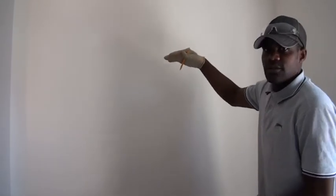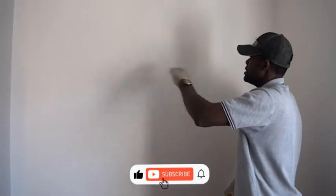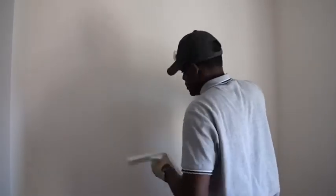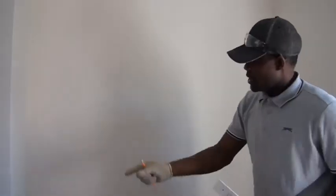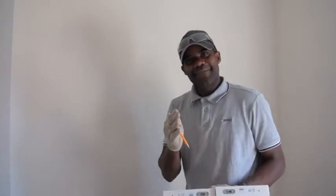Now we have our reference where we're going to fit the shelf. It's a straight line we drew. And according to the manufacturer, because it's an 80 centimeter board, the gap in between is between 50 and 60, and we just did 55, which is fine. Always in the middle, you know? They say between 50 and 60, I take 55. It's a way to go safely.